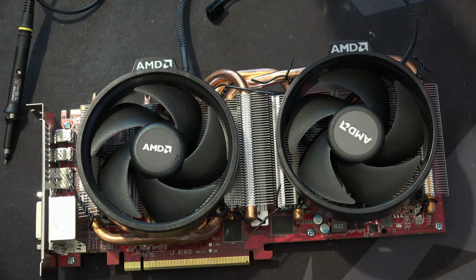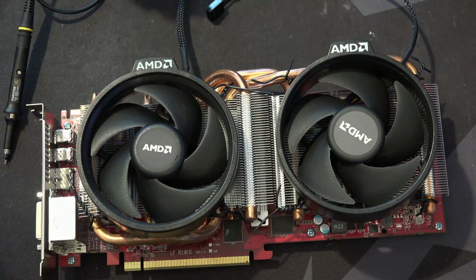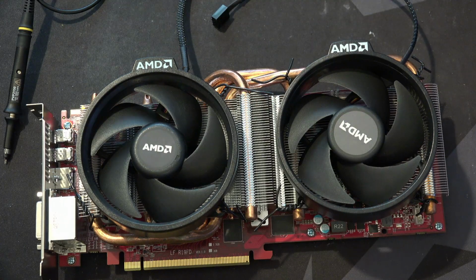Or you can run into a situation which I actually ran into with a motherboard, where I put 12 different, well, we'll get back to it. Some voltage regulators will trip OCP and they won't start, and that's the end of that. Or they'll trip OCP and try to start again, and then they'll trip OCP again and again and again, and it still won't work. End of the story is it still won't work because you have too much capacitance on there.